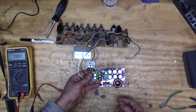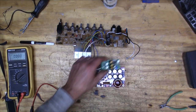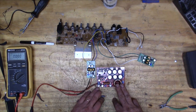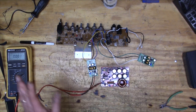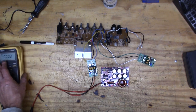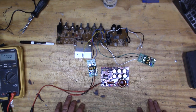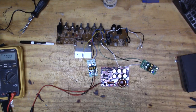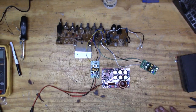This little converter here was not going to do the trick. When I looked up the spec on the chip, it's got nowhere near enough power. I had a hard time finding a power supply with split rails that's more powerful. I found this one that takes 12 volts in but has plus and minus 32 volts out at 180 watts - way too much for what I'm doing, but I converted it down to plus and minus 24 volts in another video. I'm going to see how well this works and how long it lasts. It's kind of big, so I'm not sure how I'll fit it in.